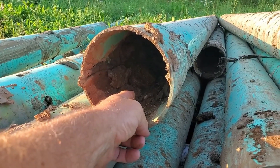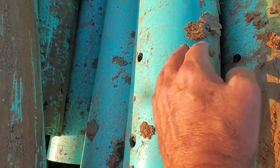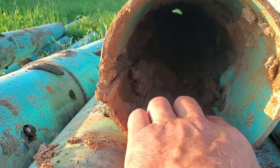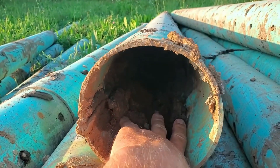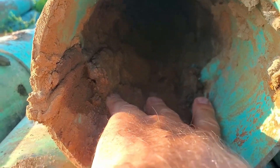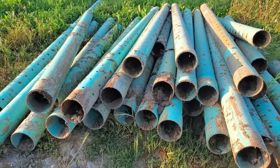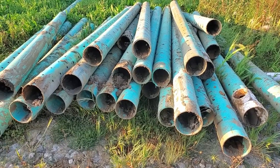This pipe has three lines of holes — you can see them right here: center one, off-center, another line off-center. What happens is when sediment ends up in this pipe — we have a line of holes basically here, here, and here — once there's sediment in the bottom of this pipe, especially if you're one of those anti-fabric guys, you're done. Those holes can't take in water.